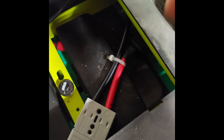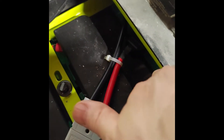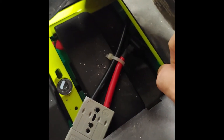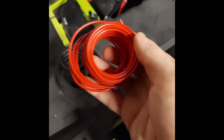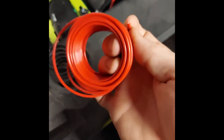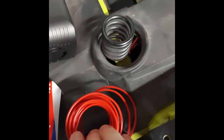You're also going to need an 18-gauge wire — or similar; I used 14-gauge — to go from the bridge connector to the positive terminal of the front battery. That just makes sure the gauge gets its reading. The instructions for the gauge show exactly how this needs to be connected. You can get this red wire at an auto parts store. What actually connects to the gauge is a small connector that also connects to the bridge — the other end of this is black cable that runs to the connection bridge. I'll show a picture of that and a link to where I bought it.